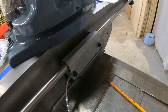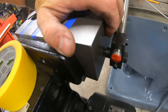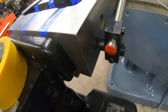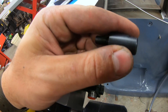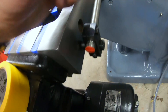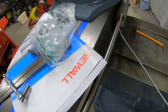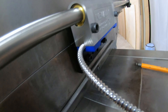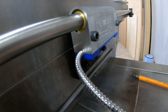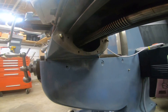I've got the X-axis mounted. What I did was drill and tap two M8 by 1.25 holes in either end of the table, and I used the longer version of these studs, which thread in and provide a stud to mount these brackets to. I did that on either end to support the scale. Then in the center, I used one of the flat brackets that came with the encoders — I mounted the encoder to the bracket and then mounted the bracket to the back of the saddle.